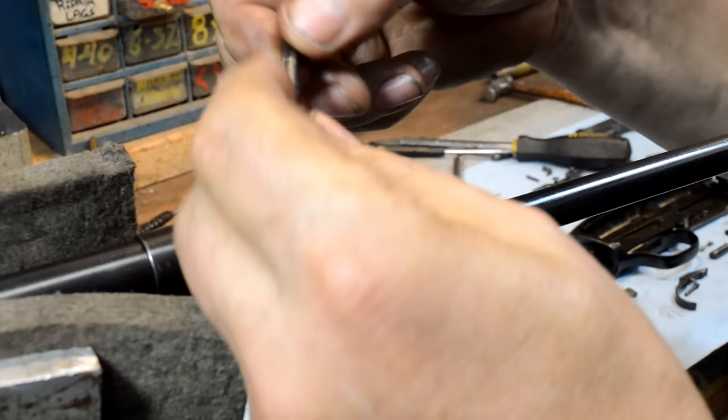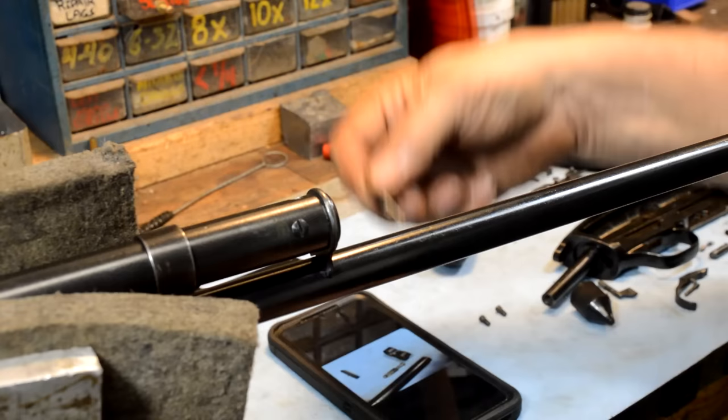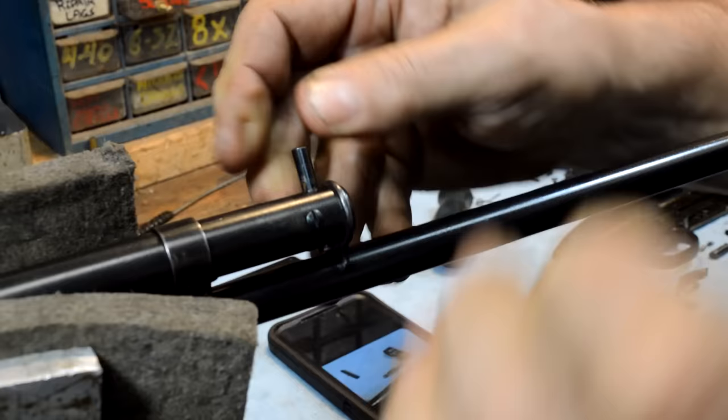And then the pin. Again, I'm back to my reference material here about how that pin actually went in. So let me have a look at that. Okay, so now I know that when the pin came out, that little dipsy doodle was up there, so that goes in like this. Like I said, I don't try to remember all this stuff. I just set myself up so that it's harder to screw myself or kick that through. So that comes up, that can roll around, and that kicks down, and that's what locks it from rotating up. Take the gun apart, pull this thing out, and bang, you're in the game.